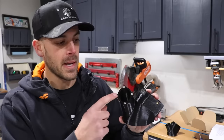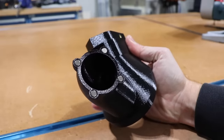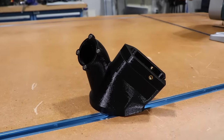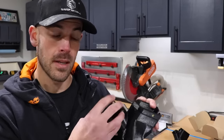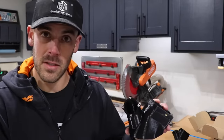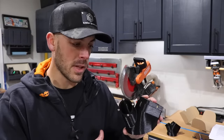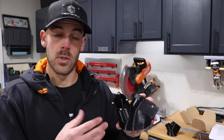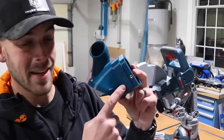I don't think the magnetic flange idea is going to work because four common 6x3mm magnets in that orientation just don't provide enough holding power for the dust collection hose attachment. I could add more or bigger magnets, but that would just increase the cost and complexity of making these. So I'm going to scrap the flange idea and go with a friction fit, which is honestly just a lot simpler. And that's how I finally arrived at this — I like to say it was version four, but it's really version eight.